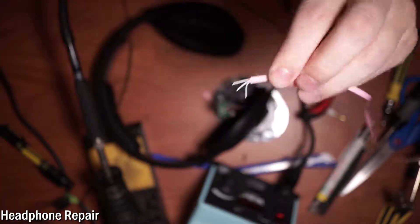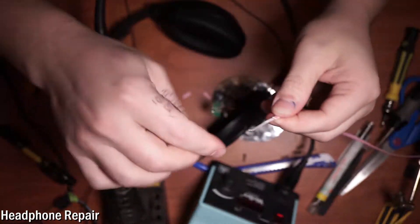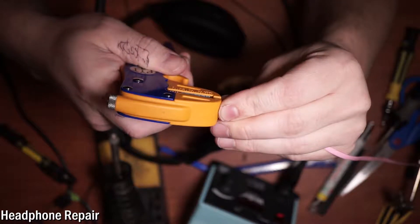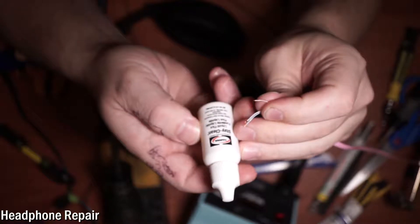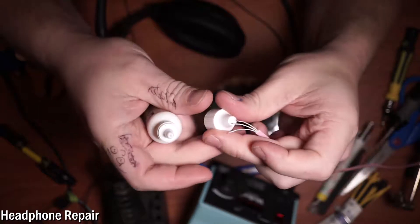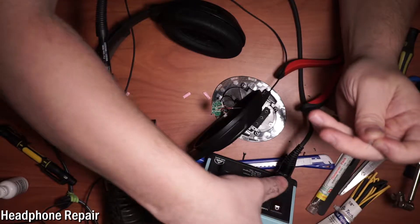In fact I do — I think this is going to work out just fine. I'll cut them to the same length, maybe just a smidge more, and we can adjust the tension so it doesn't accidentally pull anything off. Now we'll strip just the very tips of these wires. We'll add a little bit of this flux — stay-clean flux — so the solder is going to want to soak right into it. Just a dab on it.